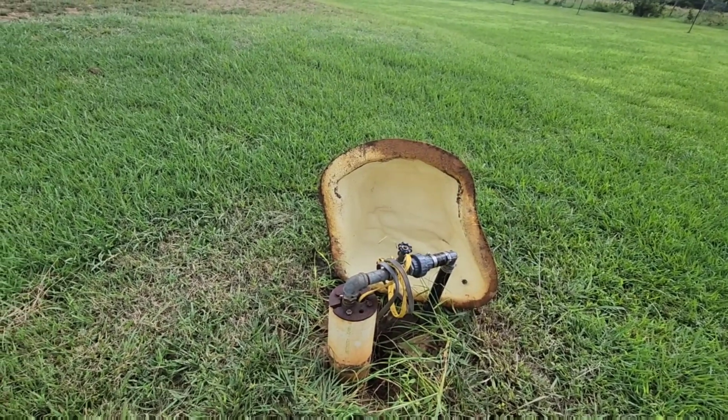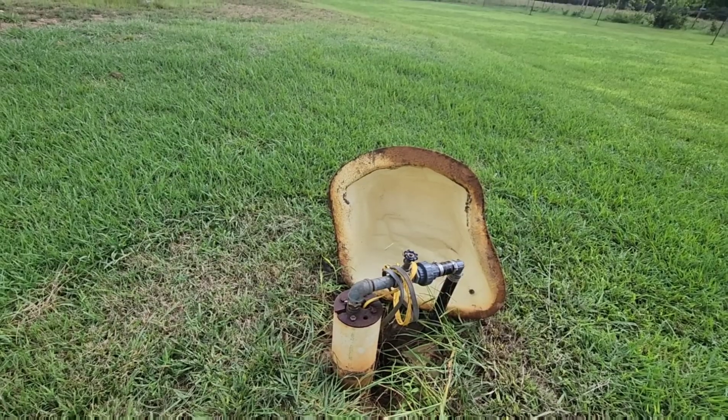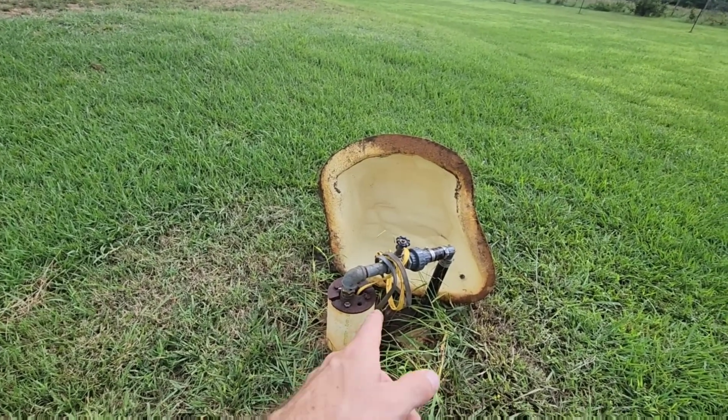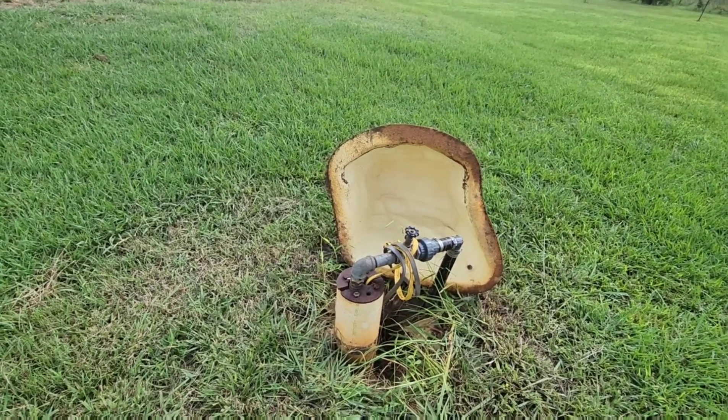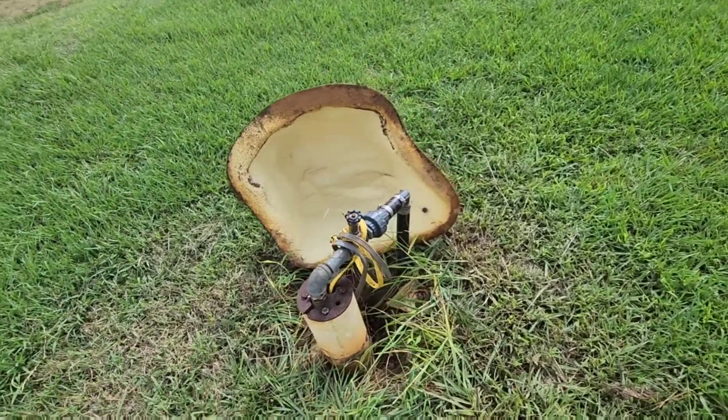So we have to pull that today. It's on an inch and a quarter black roll pipe, which is gigantic, but it makes it easier because we're going to use our electric ups-a-daisy pump puller. I don't think I've made a video using that device yet.